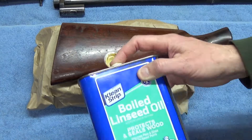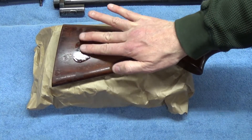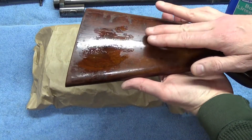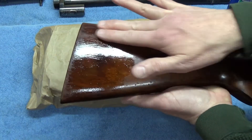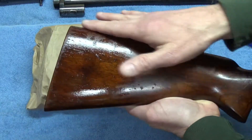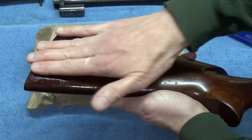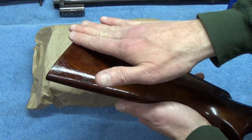I'm going to very quickly show you what I'm doing. I start with a little drop on my finger, start in one area, and just rub and spread it out. You want to take special care for the actual gaps in the finish. What I'm trying to do is fill in the gaps in the finish — I'm not sanding this stock and refinishing it that way. I'm trying to fill in the wood grain where there is no shellac or finish.